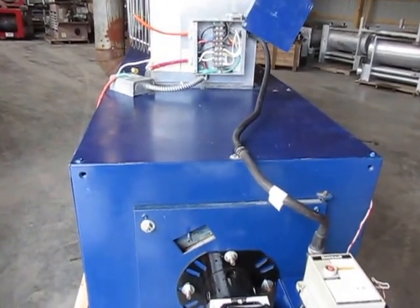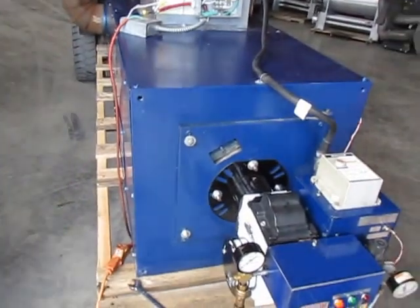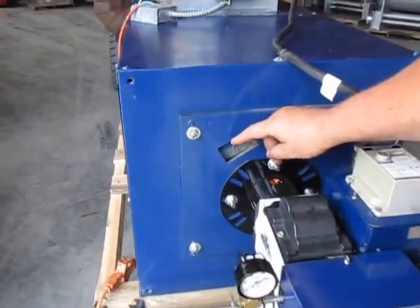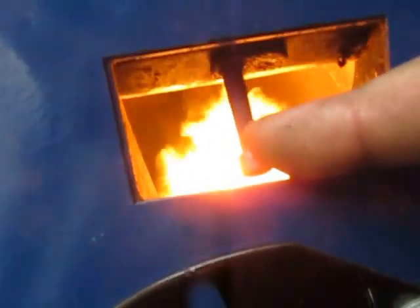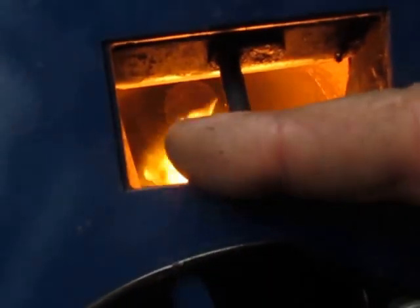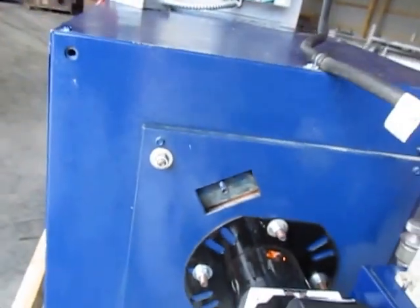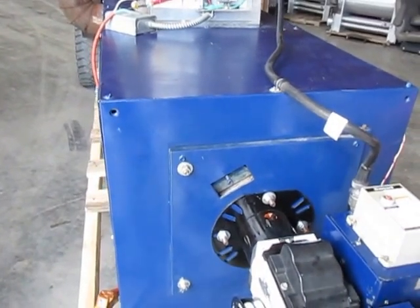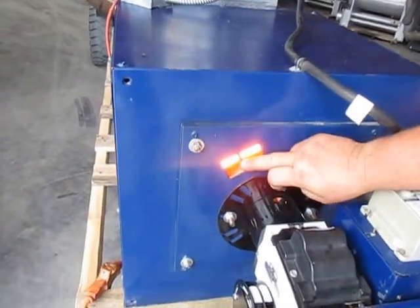Now the third category: the operational video. The flame is established here — a bright white-yellow flame that does not have a black tail on the end. You want a nice clean, soft, gentle, bright white-yellow, just a soft rolling flame. Be sure you do your adjustments after the unit has been running for about 15 minutes.